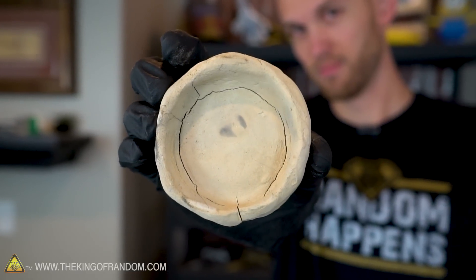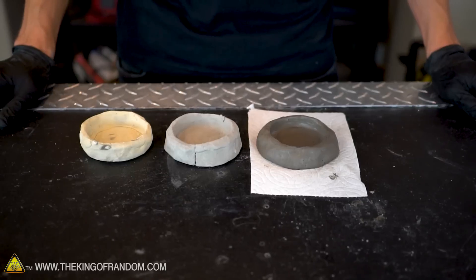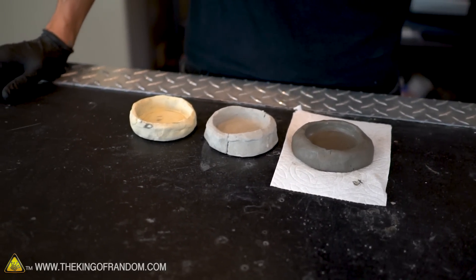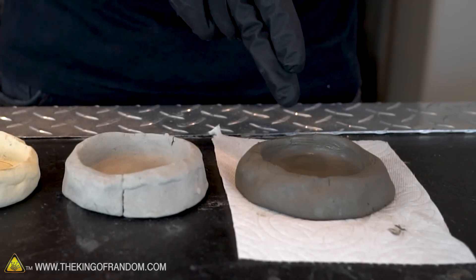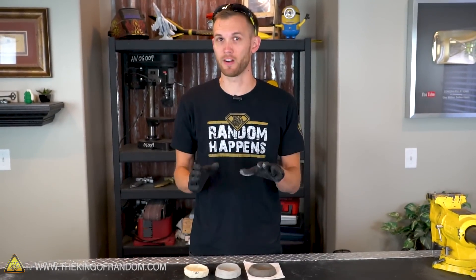I think our fired clay has the best chance of working well. It's already been fairly heat-tempered, and I don't think too much is going to happen to it if it gets exposed to hot metal. However, it is by far the least convenient — if you have to fire the clay every time before you pour metal into it, that's quite a big time commitment. The dried clay has a decent chance of working as well, but since it hasn't been fired, when the metal starts heating the clay up, there's a chance it could crack apart. The wet clay is the one I'm going to have to be the most careful with. I think when I pour the hot metal in, it's going to start forming steam inside the clay, which could cause the molten metal to bubble or possibly even splash out, so I'm going to have to be very careful with it.